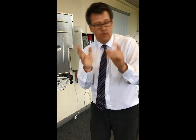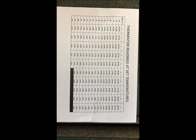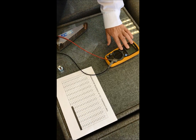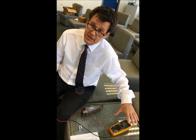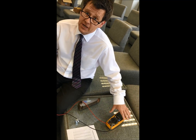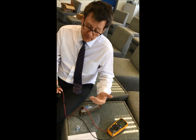I've got a thermistor sheet here — if you can't get this I'll gladly send it to you. One thing with multimeters: I suggest if you don't fully understand the operation of a multimeter, don't buy an expensive automatic one to start with. Start with a cheaper one where you physically set the range — it's like train the trainer. When you're setting the range you understand what the ranges are, so give yourself six months with a cheaper multimeter, get to know the range settings, and then by all means move on to the all-singing all-dancing automatic one.